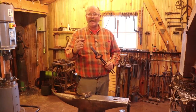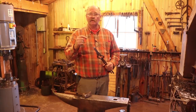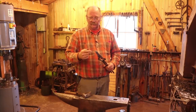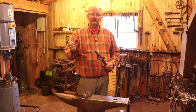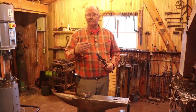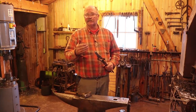And that way I'll have a half by 1 inch section that I can make the head of the dividers out of. Then we'll either have to slot punch or saw out the part that will be the two-leaf portion of the three-leaf divider head. Again, this will all make more sense as we do it, and maybe at the end of this video I'll show you a little bit more about some of these other dividers. But I also know Peter does his wing dividers a little bit differently, and I think he does punch that out. So we're going to try something like that and just see how it goes.